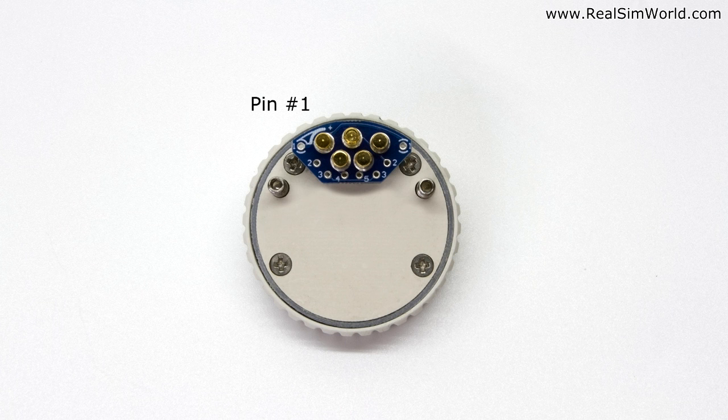The first pin from the left is 5-volt supply, and the third pin on the right is ground. They are reverse protected, but please don't exceed 5.5 volts when using with your own electronics. The center pin on the top is voltage output. It is buffered with an onboard amplifier, so please don't short it with either power supply or the ground, or else you'd risk damage to the amplifier, which voids your warranty.